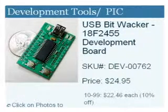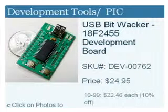This is a really cool board — a Microchip PIC hooked up to USB. It already has a USB controller on it. It comes with firmware and acts as a serial port. You connect to it and can turn on certain pins to be output or input, and send data across it. So if you develop something on one of your boards to take care of low-level bit banging, you can control it from your computer by setting the appropriate output pins and connecting it to your other device.